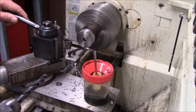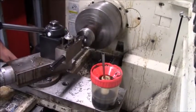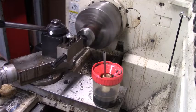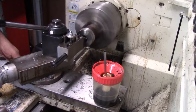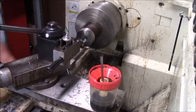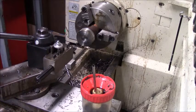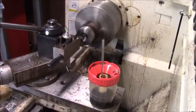Okay. So there's that piece. Then we've got to drill a hole bigger. All right, now I'm going to go in here, and we're going to take us a bore. We're going to bore the rest of it out with a boring bar. And I've went ahead and I've selected a boring bar and I've set a bottom to it. So I'm going to bore it. If you can see in there, it's a little flat to be bored. Now let me get my numbers and I'll be right back, and we'll bore some more out. I'm going to show you a couple of bores here.